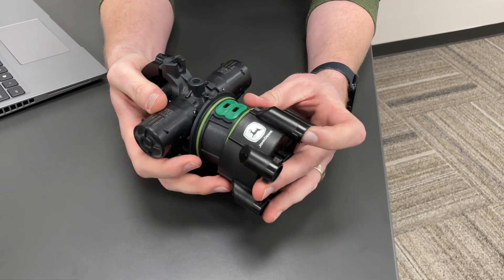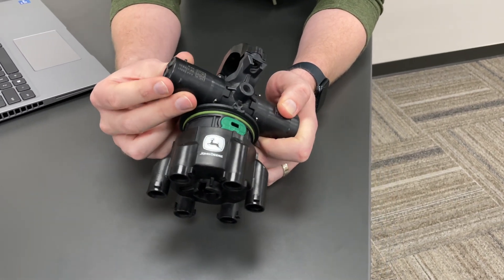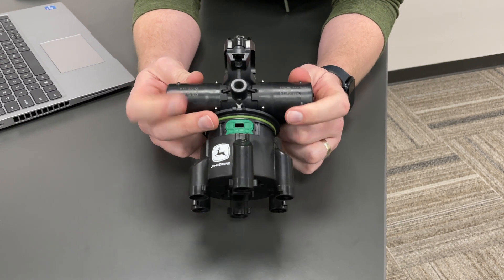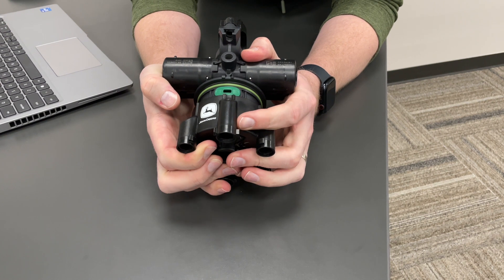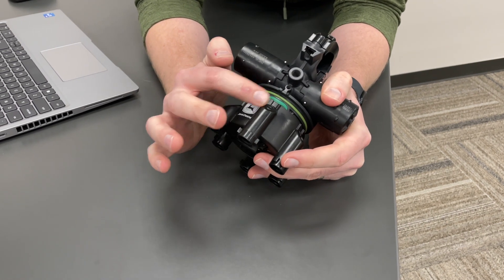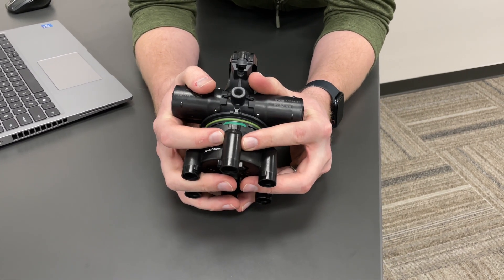Combined A plus B is commonly used for high rate fertilizer applications where we need to exceed the limits of a single solenoid. A single solenoid is only capable of 1.1 gallons per minute out of that tip, versus running both, which gets us to 2.2 gallons per minute — allowing us to reach higher fertilizer rates in the 50 to 60 gallon per acre range at a reasonable speed. A common practice is to use a tall turret on the front with a large size 20 flood nozzle for high rate fertilizer.